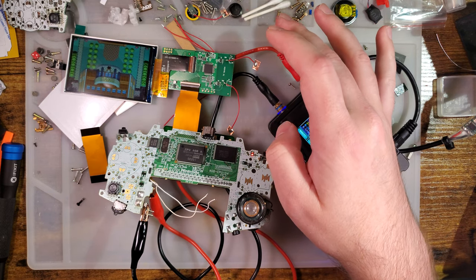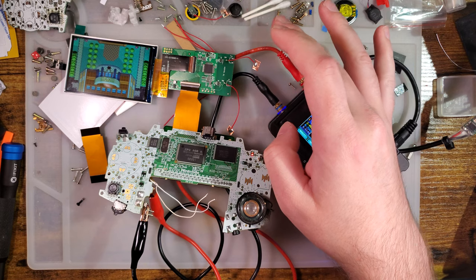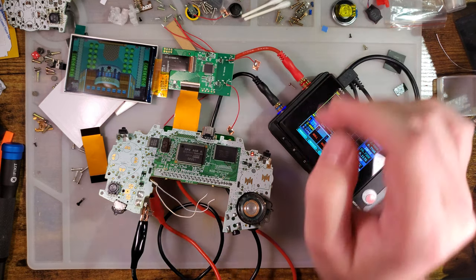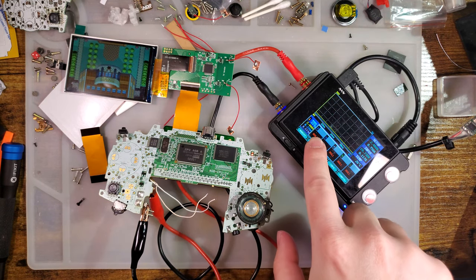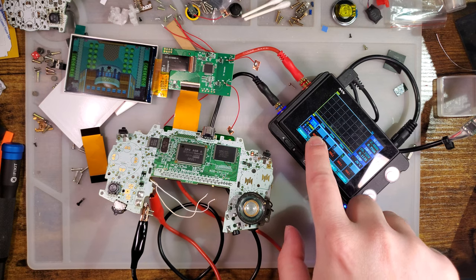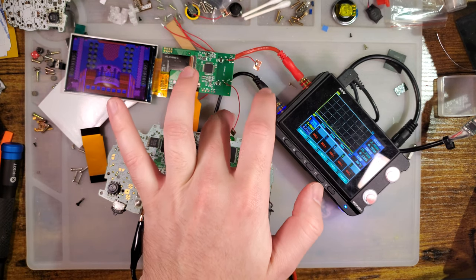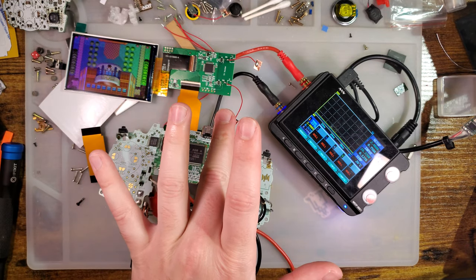That's brightness. All right, we have 1, 2, 3, 4, 5, 6, 7, 8, 9 levels, 9 levels like usual. On the lowest brightness, it's pulling 226 to 239 milliamps. Next step up, got 241 to 255. And then I bet each step is going to be pretty linear. Yeah. And then we've also got the same color palettes as the other kit.